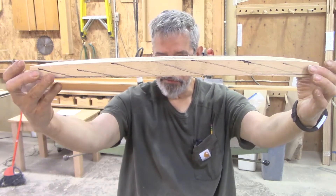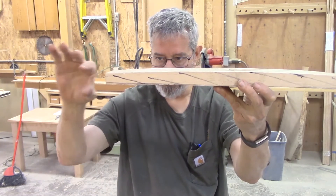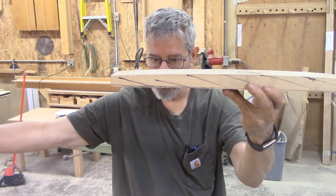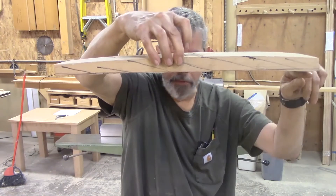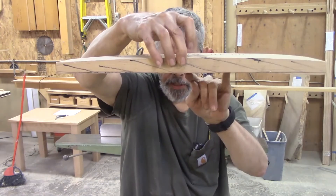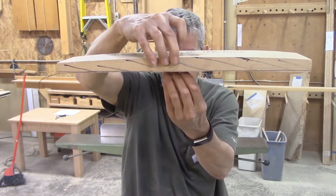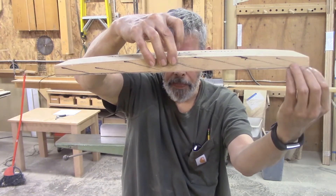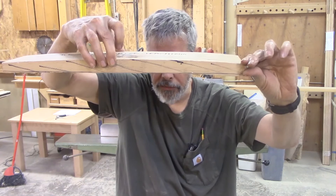This is an exaggerated board. If you extrapolate that, this curve continues right here. There's a lift to this board from this point to this point — that's up in the air about a quarter of an inch. If you want a flat board out of this board, you're going to lose a quarter of an inch right here and right here. You may not even have three-quarters of an inch left in this.